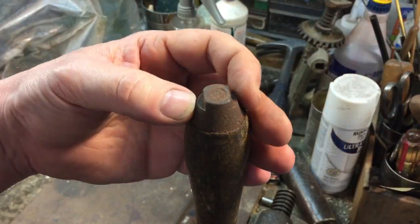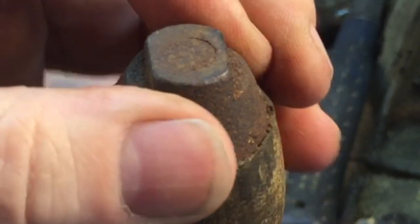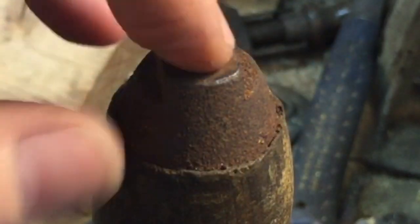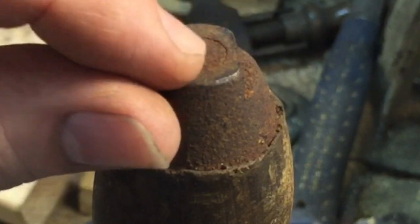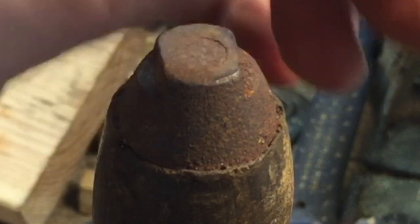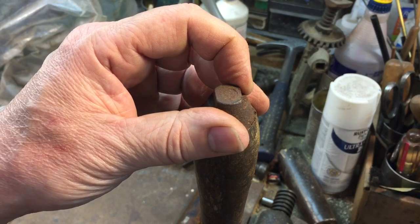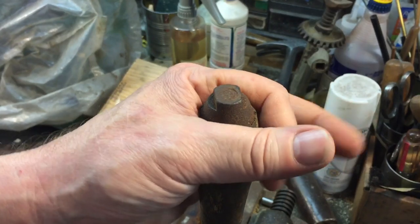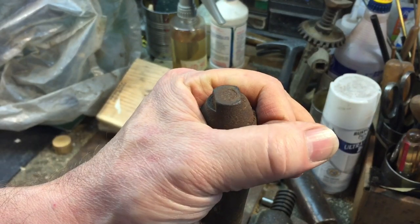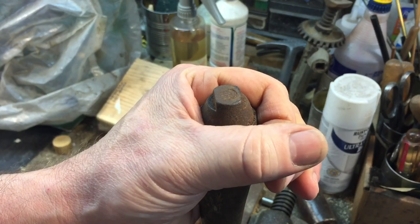There's a good chance this nut has been on there for a hundred years. Maybe we put the wrench in the vice here. I gave it just a little bit of a turn — very hard. Before you try and strip it out, the first thing you're going to do is wire brush the top of this. Then we're going to drop a little bit of 50/50 acetone and automatic transmission fluid on here as a penetrating oil. Then we're going to wrap a wet rag around here and just touch the top with a little bit of heat, and then we'll try it again.